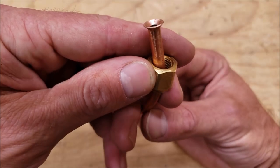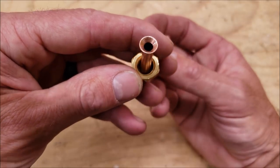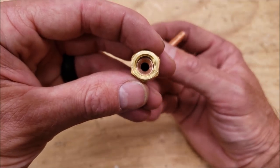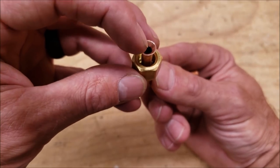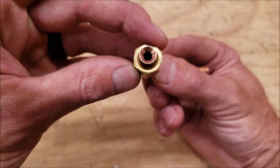And there's our flare. Here's our eccentric flare up close — there are no scratches in it and you can see that the flare fits right inside the nut. It takes up the full surface area, so it's going to have the largest amount of surface area on the joint — that's good for sealing up high pressure refrigerant.